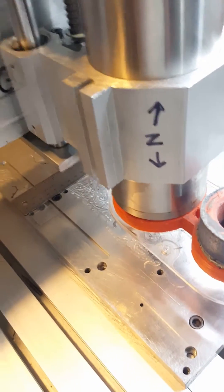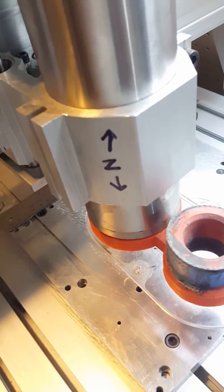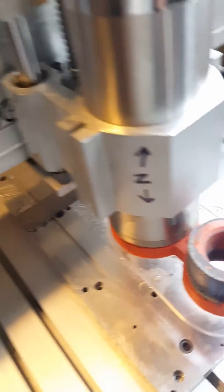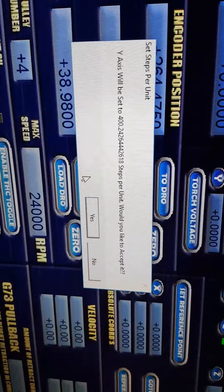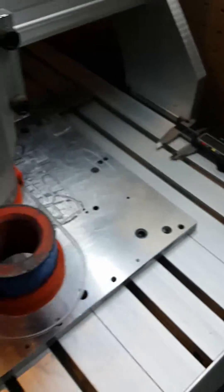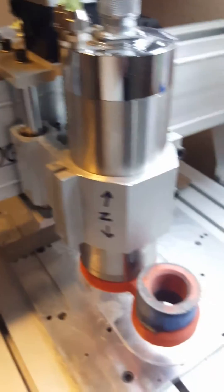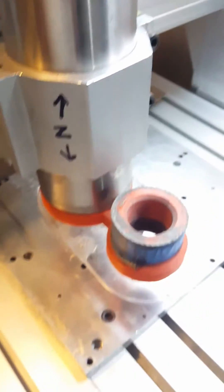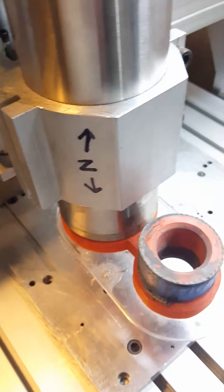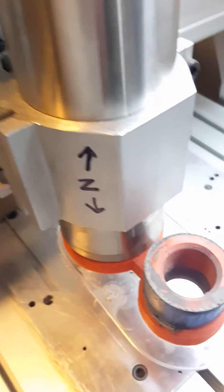So I just thought that would be an easier idea than trying to use the ruler. 124.98. So now my steps per — let's get that zoomed in — 400.24264444618. So there you go, different idea. You can probably use that on all the different axes. I did it on the X axis and the Y axis, and now I'm going to do it on the Z axis as well. Try that out. I think that's a lot easier than trying to eyeball the millimeters on the ruler, and you get really accurate. Try it out, see if that works for you. Hope you guys have a great day.